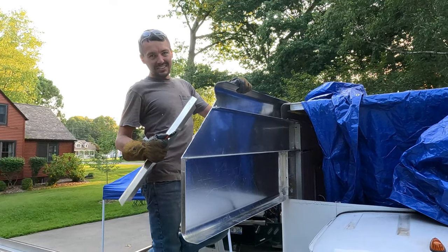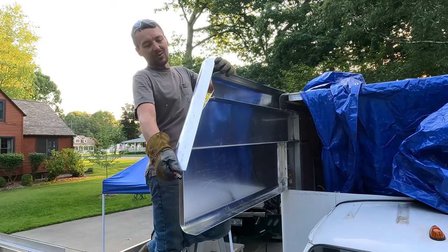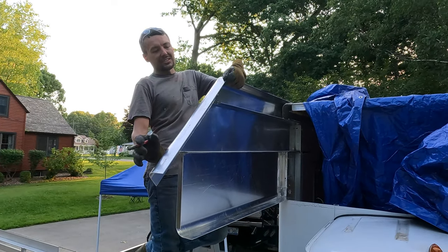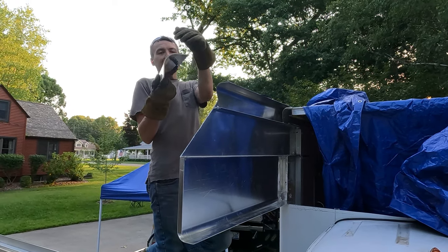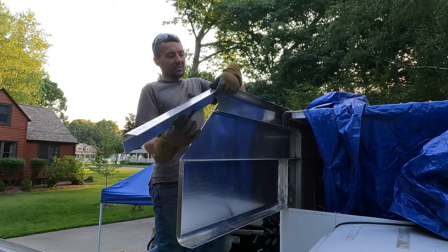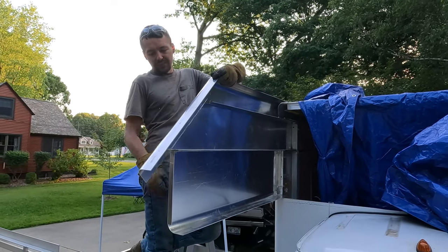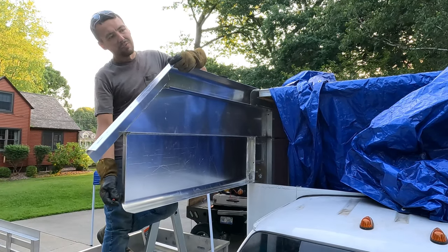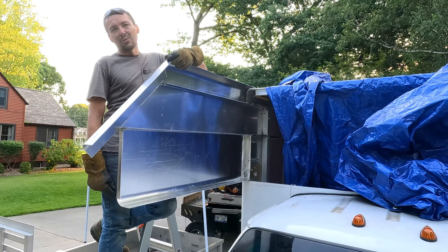Here we are, starboard side of the big white submarine. I'm just fitting up these front corners here. We decided we're gonna butt weld them. It's quite a bit of math because of the 45s and then the big old radiuses. That makes it hard to put a straight edge on the corner. So there's that to deal with. I still have to make the other piece right here, hang them down low, and then we're gonna cut them flush with the bottom just for the night to see if we can fit our new roof piece, see how it works out.